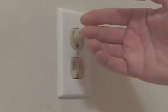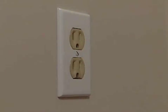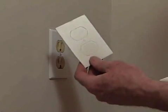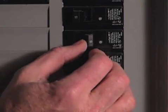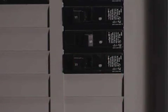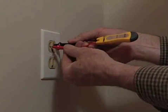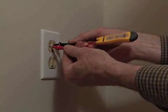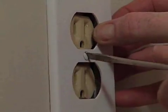Surprisingly, switch plates and electrical outlets are often sources of drafts. There are special insulation kits for electrical outlets and switches. To install, first turn off the power at the breaker box. Using a voltage tester, make sure that the electrical supply has been turned off. Unscrew the electrical cover plate by removing the screw holding the plate in place.